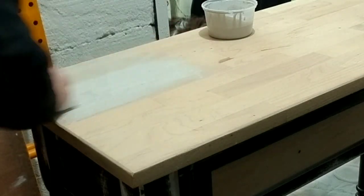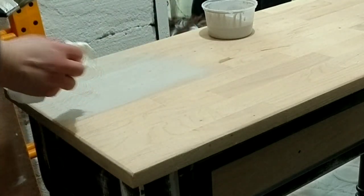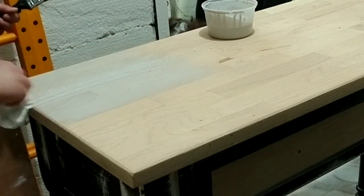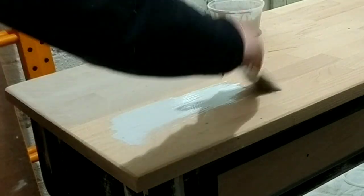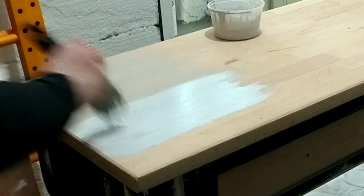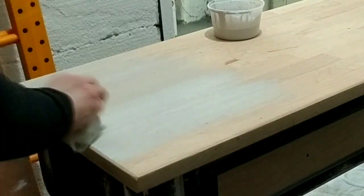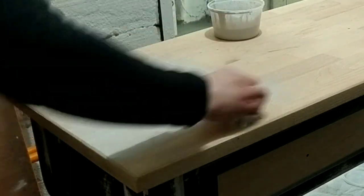It's just very similar to how you would apply stain. The paint gets very thin when it's mixed with water, so it's extra drippy. You just want to make sure that you don't have puddles building up, so always make sure that you're using a clean, dry rag to wipe off the excess paint. I worked in small sections — I'd use a paintbrush to apply a little, then a clean dry rag to wipe off the excess.